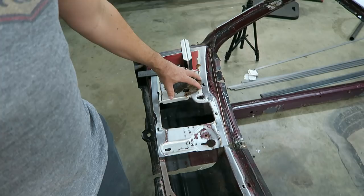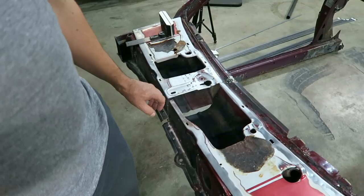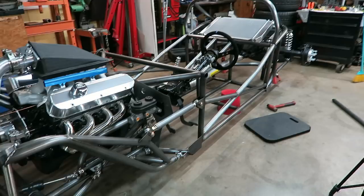The cowl piece will all be aluminum with an aluminum top. I think the fuel tank is going to go in here and I'll do it like a fuel cell — have it bladdered and everything for safety. I'll probably put maybe an AN three pump hat here so it's exposed with the lines kind of showing. On this side there'll be a fuel cell style filler so you can fill here, pop that thing off. I'll make all new steel sheet metal, a new firewall, and an aluminum tank that just kind of sits down in there with a big lip that I can fasten to — maybe a little trim ring. I can run two 85 pumps in-tank, have the lines come out nice and exposed, and save space, weight, and money because I don't have to run lines all the way to the back.